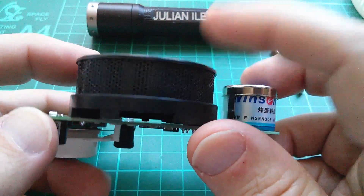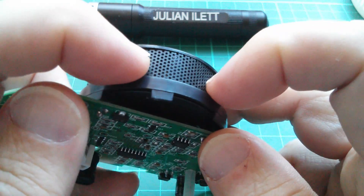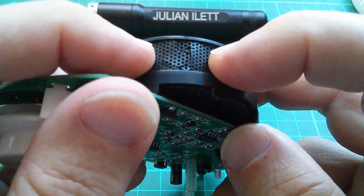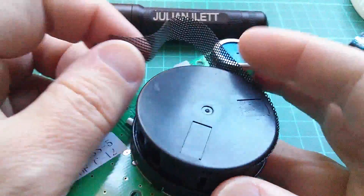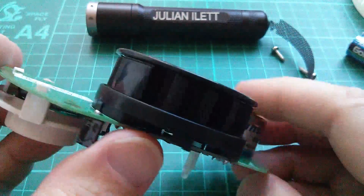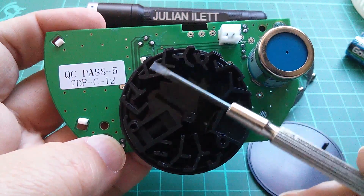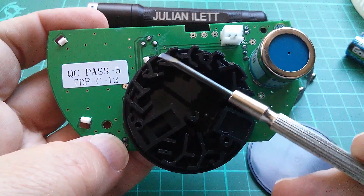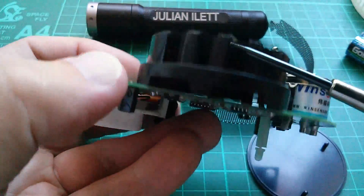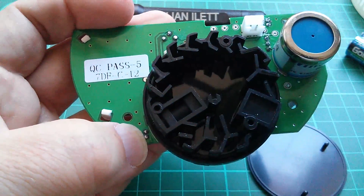Now we come to the smoke detector — there are no identifying marks on it at all, but it has this filter with punched plastic. I thought it was metal at first. It comes off quite easily, and then it's just a chamber with lots of interesting holes. Taking the top piece off, it's a chamber with angled pathways — presumably so that ambient light can't get in. There's an emitter on one side and a detector at a differing angle, with connections visible on the underside. So it's just a simple dark chamber.